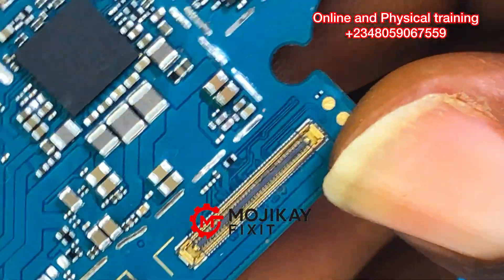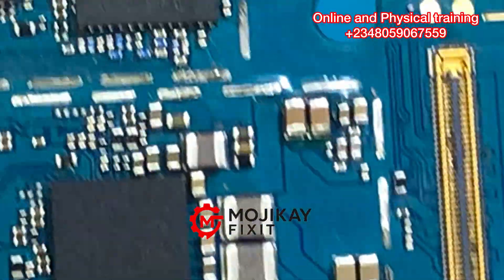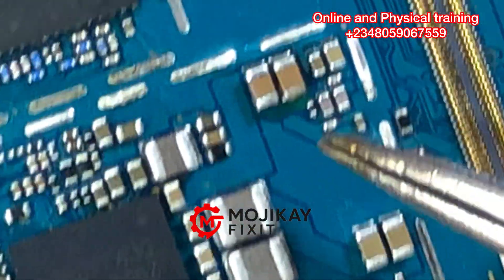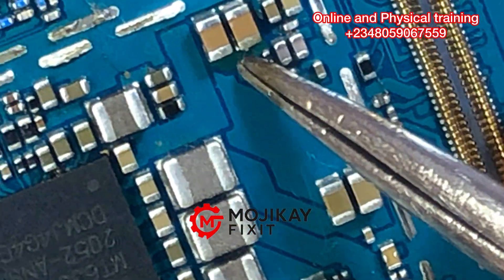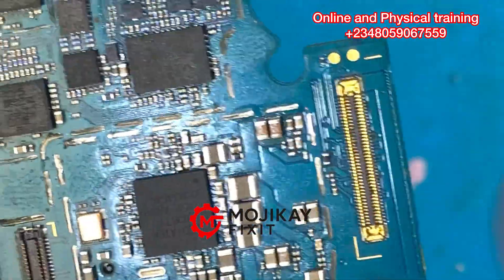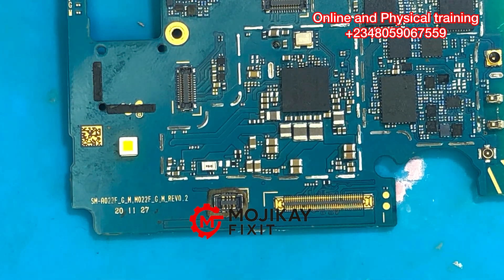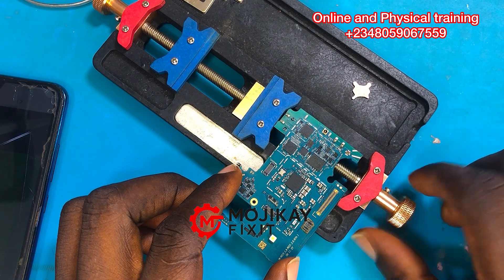Taking a closer look at the physical inspection — you can see there is a brownish color that is different from the PCB's main color. That discoloration is between these two capacitors, which means heat has been building up in that area and has turned the color brown. This is why physical inspection alongside troubleshooting is so important.